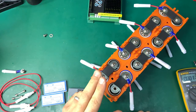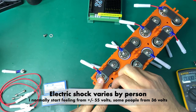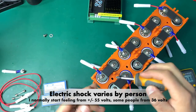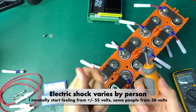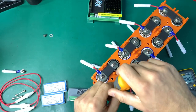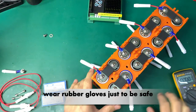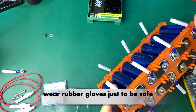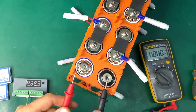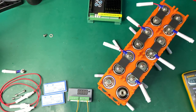A big spark like arc welding — so you've got to be always very, very careful. Always hold the bus bar with your fingers. Some people may get an electric shock; I normally don't feel anything up to 55 volts, but some people start feeling it from 36 volts depending on moisture and oils in their hands. You can wear rubber gloves. Measuring the whole pack: we've got 46 volts — the battery pack is ready.